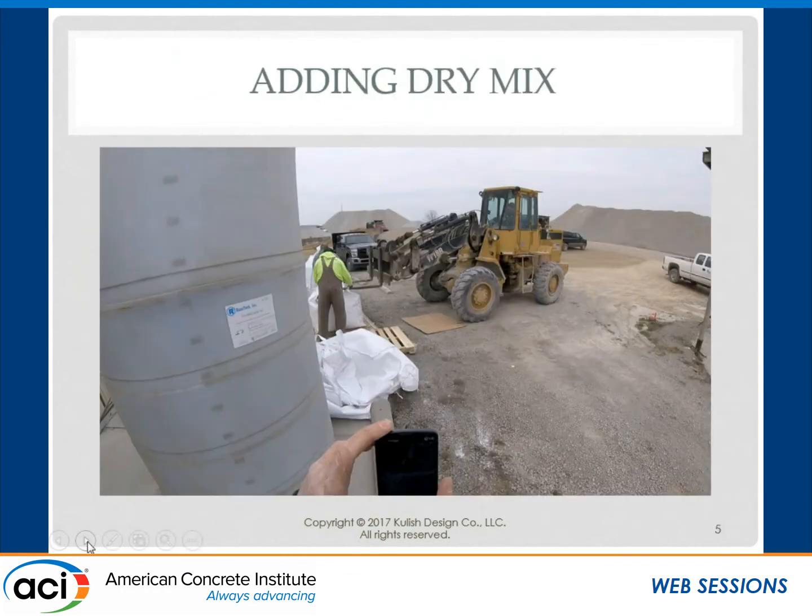We pick up the super sacks, cut them, and drop all the product into a traditional Readymix mixer that has 16-inch welded spiraling fins. A lot of energy. We're spinning that down to make sure that all my nano and sub-nano particles are being thoroughly incorporated, even though my batching has already done that. Then we add the metal fiber. There were four challenges I found with trying to do this in large production.